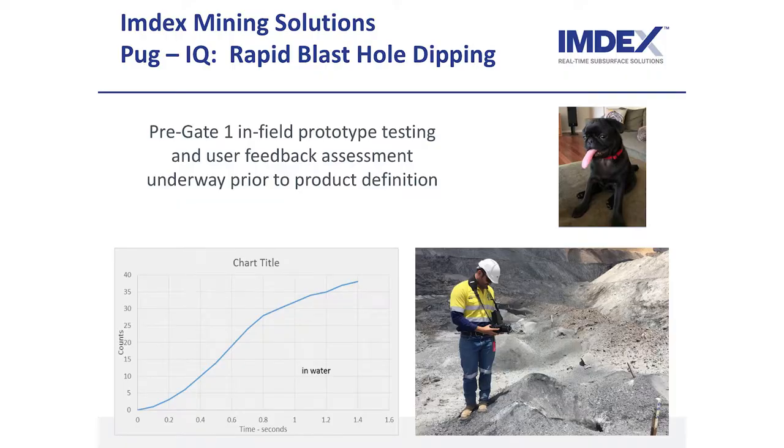And we're also doing some work because we think in using this additive in the air in the blast hole rigs, you actually get a much better sample for grade control. Now, everyone whinges about sampling cones around blast holes drilled by blast hole rigs, but because we're going to prevent fractionation and the wind blowing the fines away and all of those sorts of things, you will be able to cut out a nice sample, literally like cutting a piece of cake, and get yourself a nice representative sample. So we actually think that that's a driver in its own right.